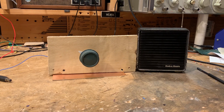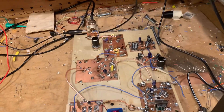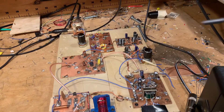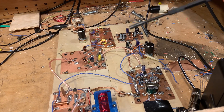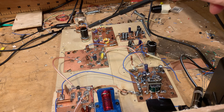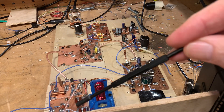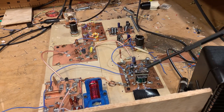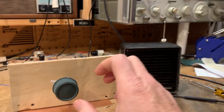I'll give you a quick band scan with the DC receiver. Right now I have it hooked up with just the two transistor amplifier — no preamps. It goes: bandpass filter, RF gain control, bandpass filter, mixer, PTO buffer, and then two stages of audio amplification that goes to the unamplified speaker.